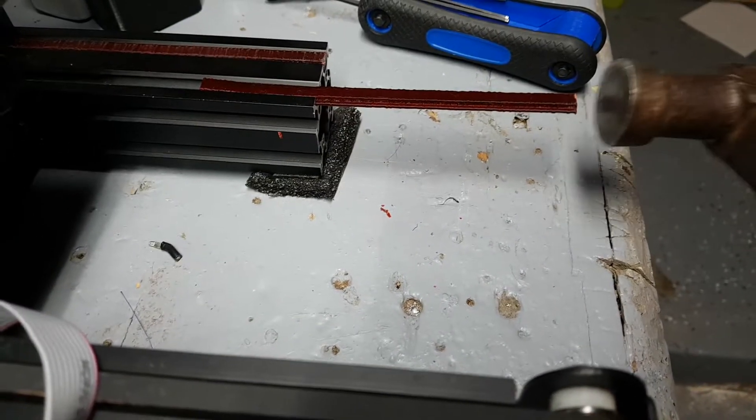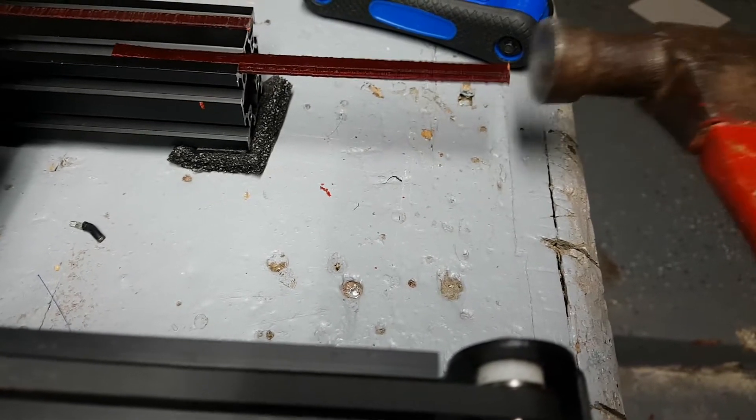I've already installed two of them. You're going to hear me with a hammer hammering this stuff in. The reason I am hammering these in is I made a mistake — I sized these wrong. When I set up Cura, I accidentally set it for 105%, which made them too big. I'm also using my 0.6 nozzle. Probably if I print them with a 0.4, it may be better.